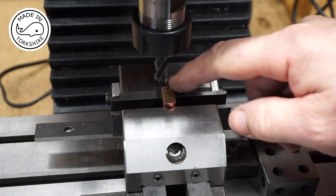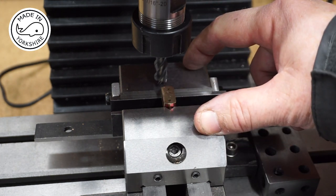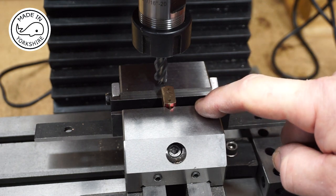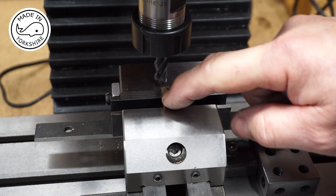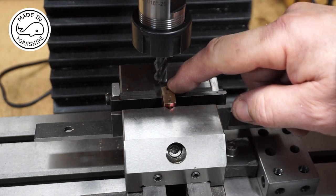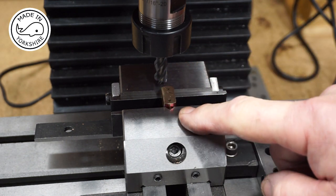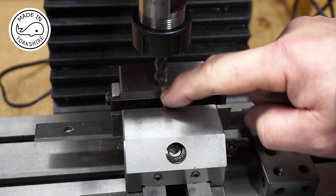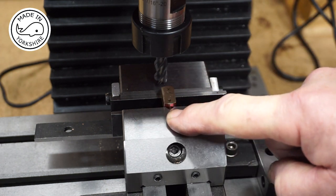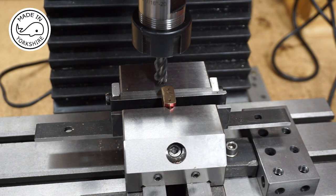Well, I've managed to hold the long piece of the Conrod in the vise, supported with some parallels. I'm pretty happy with the accuracy of the surface as it is at the moment. So I've just touched the tool on each corner just to make sure it reads zero, and it does. So I'm happy that the piece is sat correctly and is parallel with the top of the vise. So what I'll do off camera is skim off 50 thou, cutting at probably 10 thou increments.